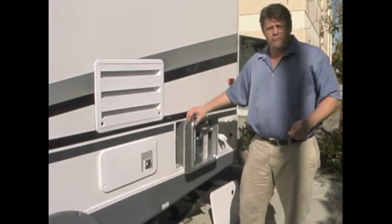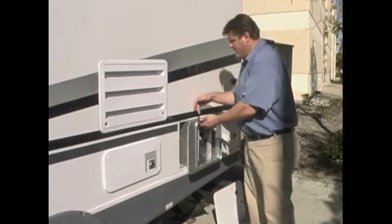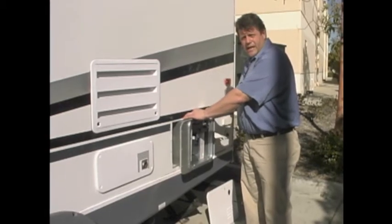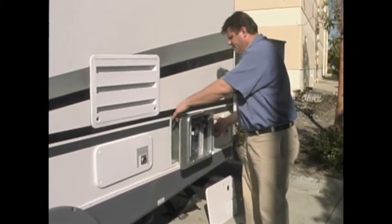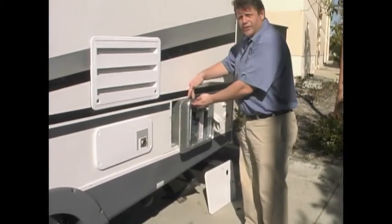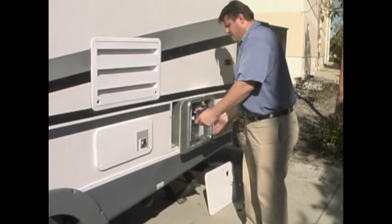At that point in time, what we'll do is apply screws or rivets, and we have two pre-drilled and pre-aligned holes on each side of the water heater. So we will apply drill-in screws right here, here, and then all the way around.